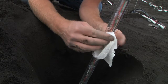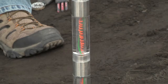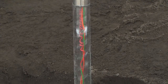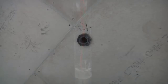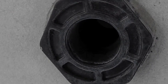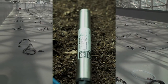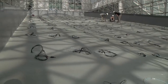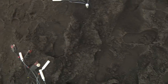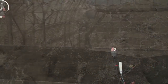The disadvantage is that it will be difficult to actually replace sensors or samplers, since it's a sealed system. The other type of penetration we have are these small hexagonal plastic fittings with a slightly smaller opening — those are for a pressure sensor called a piezometer. These sensors measure water pressure, specifically the amount of saturated soil above those locations — the depth of soil that is 100% saturated with water.